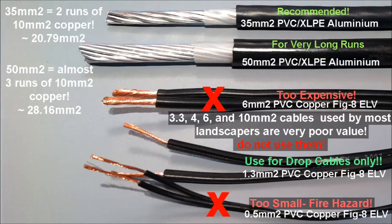Don't use this as your drop-off cable because it's too thin and is a possible fire hazard. I suggest the 1.3mm square, which is typically the smallest sold in a hardware store, be used for your drop-off cables. But you can also use ordinary building cable in 2.5mm square, which is just as good and cheaper.